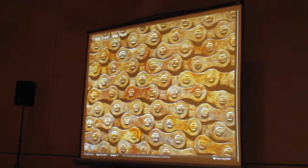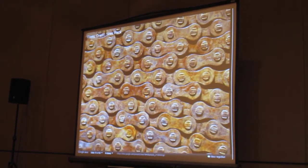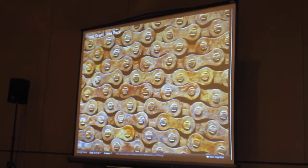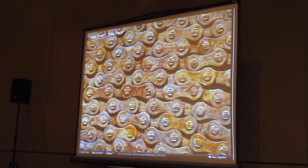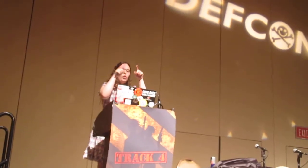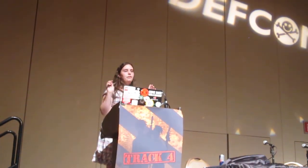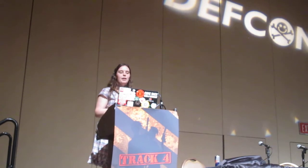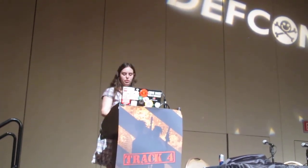Alright, chain. You all know what chain looks like, here it is. Chain stretches. I know it's metal, but it stretches. This is because there are little links, you can see the little links, like these guys, they're little eight-shaped things, and you put a post through the two ends of it, and as they wear, the holes get bigger. So chain, as you use it, will stretch about 5%. And people don't expect that because they're not used to the concept of metal stretching, but it really does stretch.